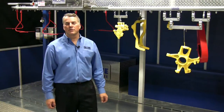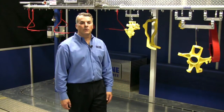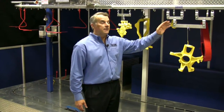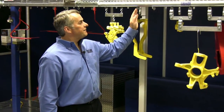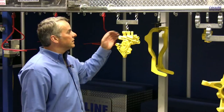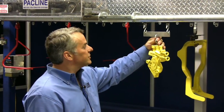Hi, I'm Carl Schultz, President of PacLine Corporation and PacLine Conveyors Inc. If you have an overhead conveyor, there may be instances where you want or need to use a load bar. A load bar is an easy way to distribute the load that you're carrying over more of the carrying chain. So on this particular conveyor behind me, we have a capacity of 50 pounds from each of these hanging points. So if I had a load of 100 pounds, I might use a load bar to distribute the weight across two pendants such as this. You can see here we're connecting to two chain pendants and hanging the load from one position under that load bar.